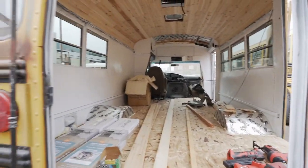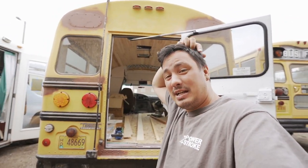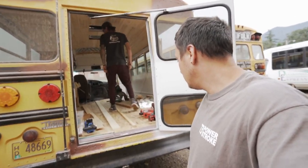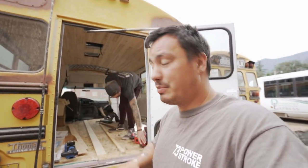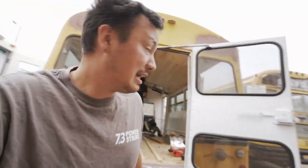And we just used liquid nails fuse it max, which if you've seen in my last subfloor video, I used that Sikaflex stuff, worked amazing, but that stuff's like 20 bucks a tube. We used Gorilla Glue, it didn't bite, and this liquid nail stuff worked. So I'm hyped about that.